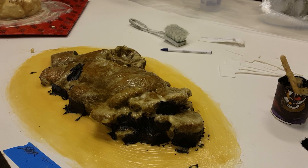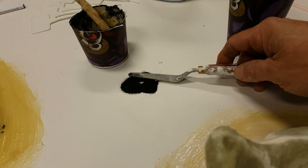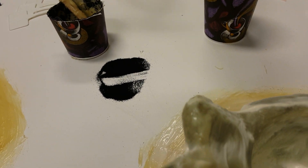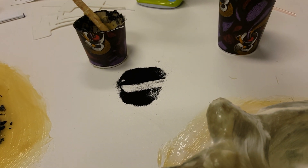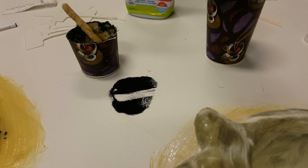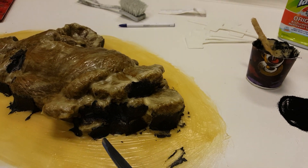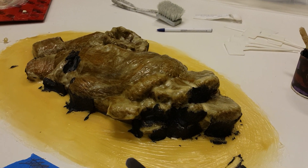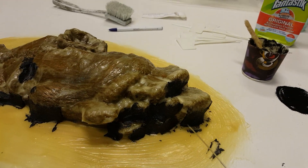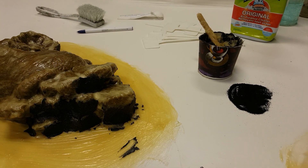What I'm doing is I've made a couple small posts on the forum using this new thing I've got my hands on: crumb rubber, or rubber crumb, or some people call it rubber powder. It's right here — it's really hard to find, but lucky me I found it on eBay from one of the members on DIY Molds. I'll put a link in the description so you can find him if you're interested. It's ground up rubber, and what we're mixing it with is latex to fill deep undercuts. I used to always use poly fibers from pillows — you'd soak them in latex and use them to back into your undercuts. This is what a few other members, Tuscany and JB, use a lot.